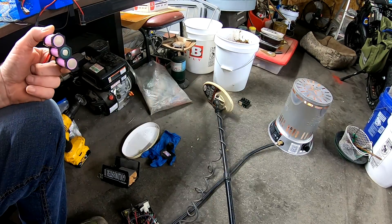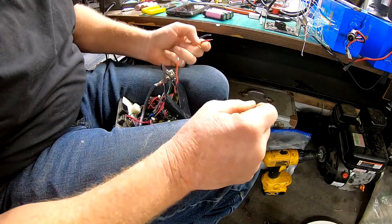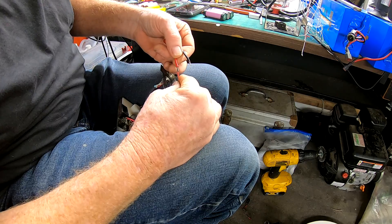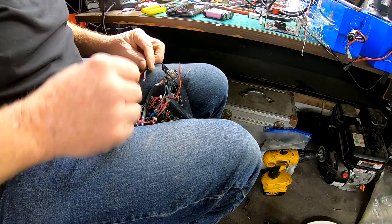Yes we are. Peace baby. In the military, years ago — you wind them, you get twisting strength, solder them, and then typically you just lay a bead of solder right like that, and heat shrink over. And that's what I do.